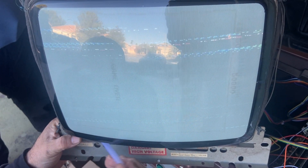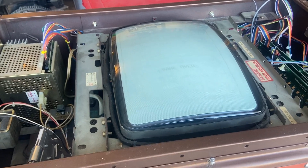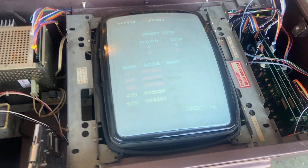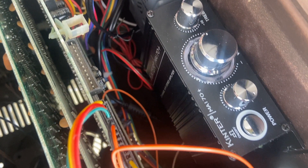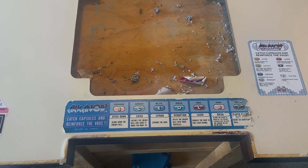The CRT was in good working condition except for a horizontal sync issue. I'd get it a cap kit and get that fixed from Sharp Image Repair, and then it would look wonderful — a little burn-in, but that's okay. As for the audio, I used a line-out converter with an amp instead of using the audio from the chassis. A little easier to control, as well as a little bit more modernizing it.